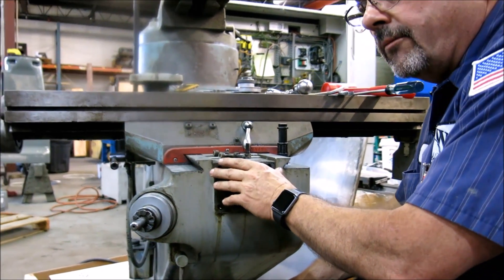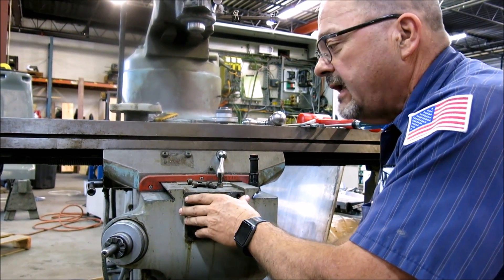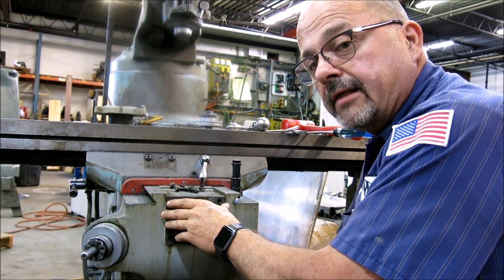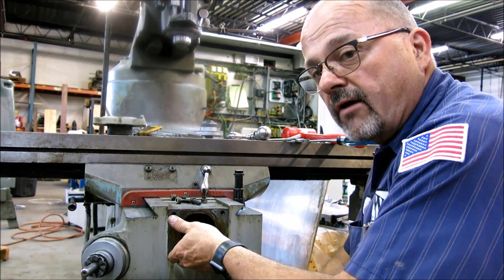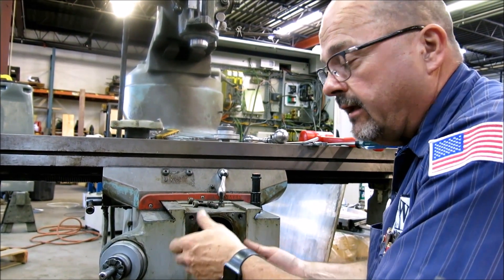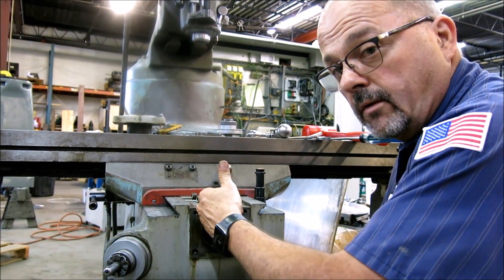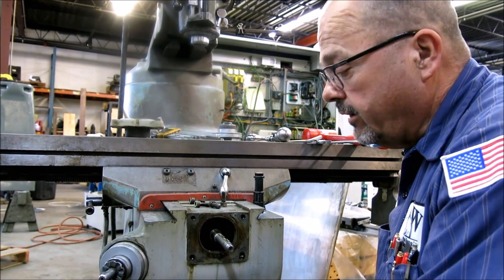Your goal for a brand new screw and nut is three to five thousandths. You have to take into account how much wear is in your screw. But if you can get it ten or less, that's really what you're targeting. So if you get it done and you're still at twenty or twenty-five, take it all apart again, readjust it a little bit more, and once you get it where you like it, crank it all the way in and out — you may need to loosen it a little bit more if you've got a lot of wear in your ways or your leadscrew.